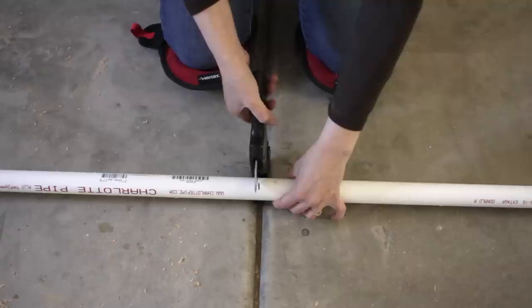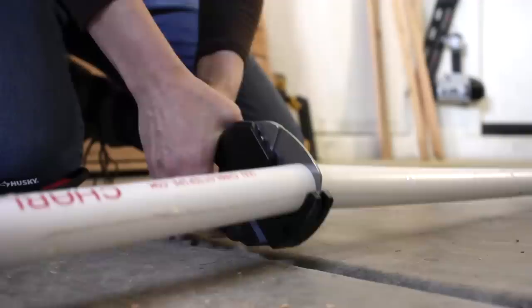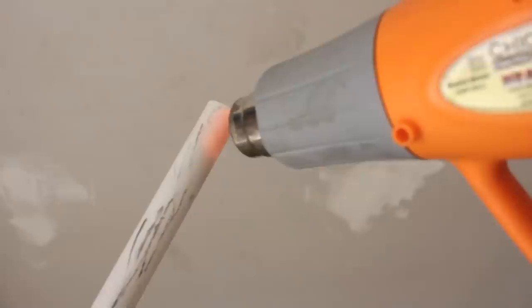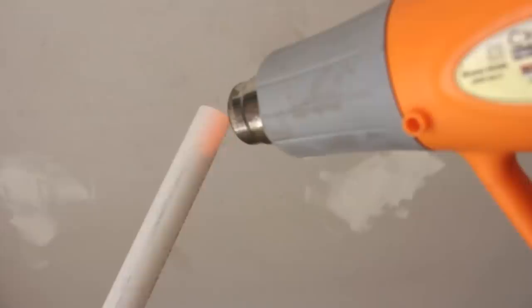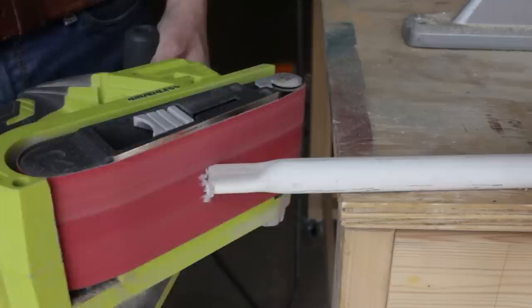The leg assemblies needed some diagonal support arms, so this is where the PVC pipe comes in. I started with one-inch diameter but then decided I liked the look of three-quarter inch instead. I have all the measurements in the building plans, which you can find by clicking the link in the description box. To make the support arms easier to attach to the legs, I wanted to create a flat section on each end of the pipes. Working on one end at a time, I used a heat gun to soften the ends and then one of my metal face clamps to smash it flat. Once it was cool, I clamped the PVC to my workbench and used a belt sander to round the corners.